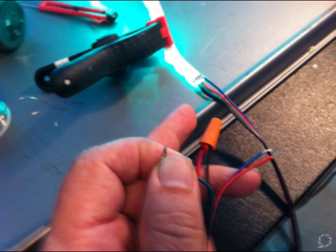Once they're all soldered together, then you want to do a bench test to be sure that each channel is connected correctly. So you put the positive — in my case which is black — on my red input, and then individually go in and check and connect the green, red, and blue to be sure you get green, red, and blue light out of your light strip.